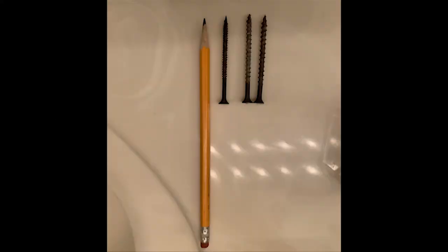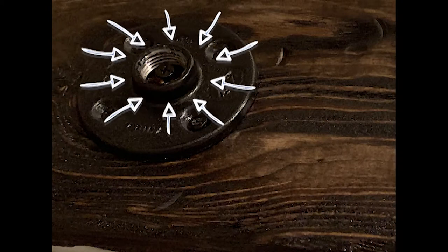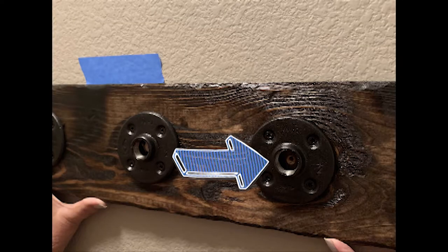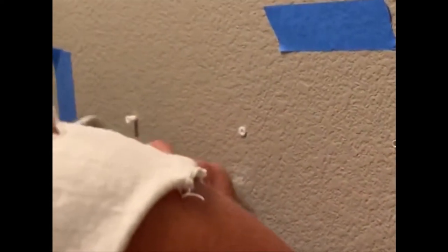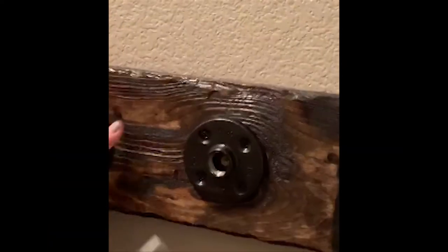In step five, you're actually going to attach your flanges to your board. Here I'm showing two inch screws, but we're going to use a smaller screw — probably like a one inch screw — to attach them to the board itself. After which you're going to drill a hole in the center of each of the flanges that goes all the way through to the board. We want to take a Sharpie marker and in that hole mark where it's going to hit the wall after we've put the board on the wall and know that it's level. Then remove the board, drill your holes, and add drywall anchors to it.